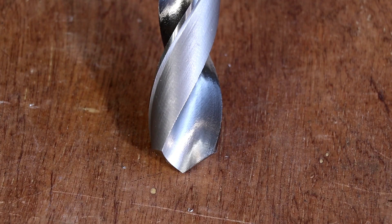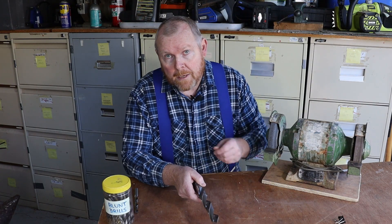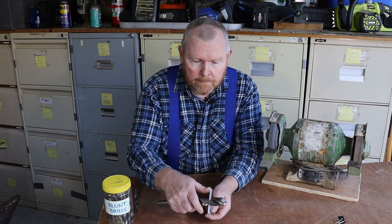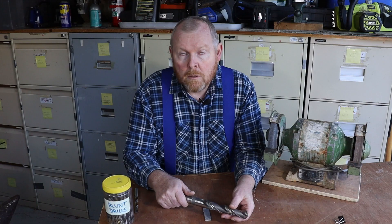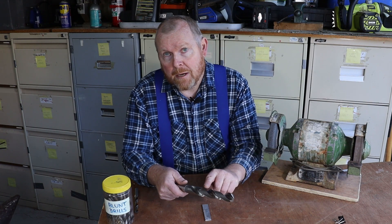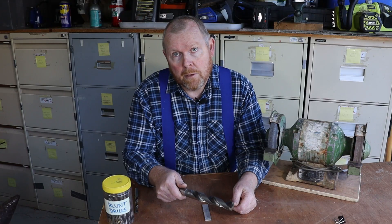The tip of the drill has two cutting edges, which are also formed by grinding. These are the cutting edges that we'll be sharpening with our bench grinder. The edges of the flutes are also cutting edges. It's not possible to accurately sharpen the edges of the flutes using a grinder like this, and even if we could do it, we'd end up reducing the diameter of our drill bit.